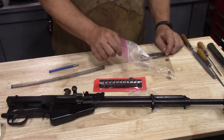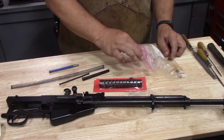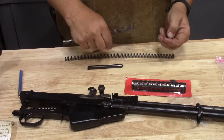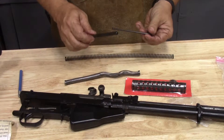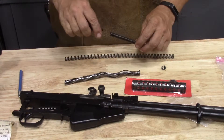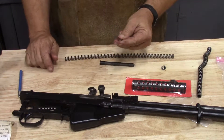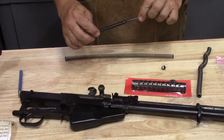This is an unused recoil spring. If you're familiar with AKs, you're going to be familiar with how this works. This is an assembled one I pulled off of another SKS — this part captures the spring on here and it sits inside this. This is a brand new piece from an import lot from the 80s or 90s, so it's a little different. You'll notice right away that we have a problem — it's not going to fit and slide the way it's supposed to. This is normal with mishmash parts. I'm going to take this and turn it down just a little bit — just have to make sure it doesn't get too small.